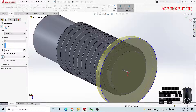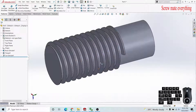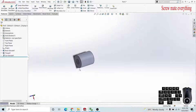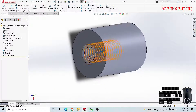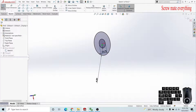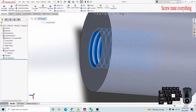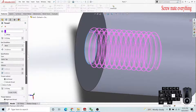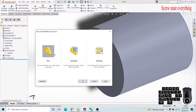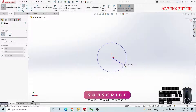After that you can have this nice edge for the mate. I increase this cut to 0.8 so it will be clearly understandable. Then I'm going to make the hollow part. This hollow part contains a 5 millimeter diameter. I need an extruded cut thread here using a cut thread under the metric tab. I will create this now — go in and apply a new part, then on any plane we can have that design.